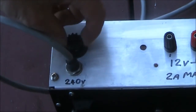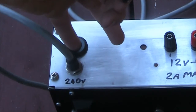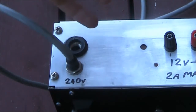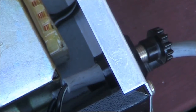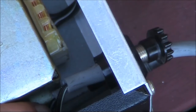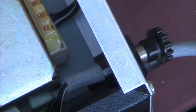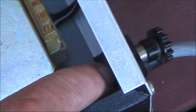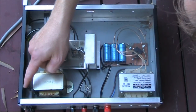An important thing with a fuse holder is that because it is at mains voltage, you don't want a situation where you could be in contact with mains voltage if someone were to inadvertently remove the fuse holder. You can overcome that with careful wiring. What you want is for the contact at the back of the fuse holder to be the one connected to the active of the incoming mains cable, and for the transformer to be connected to the front connector — the one you'd contact if you stuck your finger in. Note that the fuse must be in the active line.